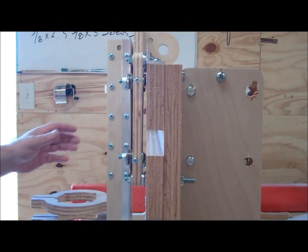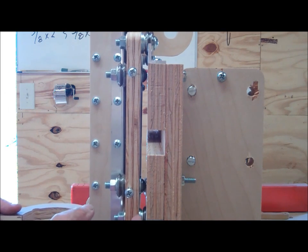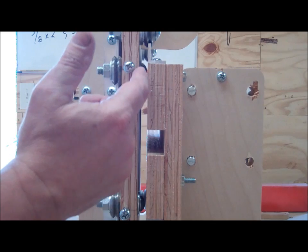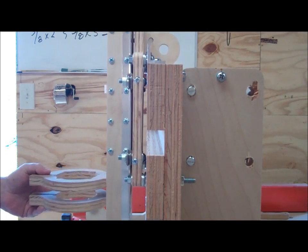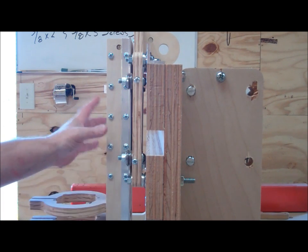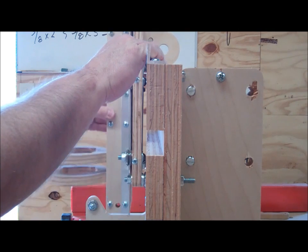Here's a close-up view of the side. You'll notice I've got a couple of extra washers on these V-groove bearings so that the plate sets off far enough that it just misses the heads of the screws on the other side — about a sixteenth of an inch clearance. Also on the Z-axis, I've got a dowel nut and a screw so that once you push this in you can tighten it up and push the bearing over against the rail to take all the slop out and get really nice motion.